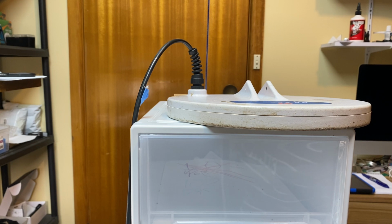But have a listen to this thing, right? This is how much electrical noise we've got here. It's all over the shop. I'll do a frequency scan on it. It will make no difference. You can hear it, it's just, you know, ee-oo. Yeah, just lots of harmonics of the mains or people's noisy TV sets, more than likely.